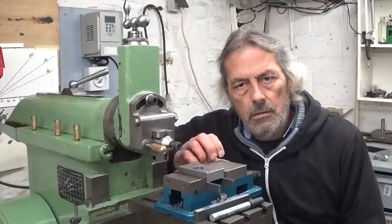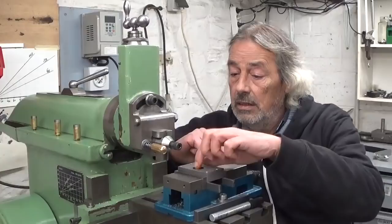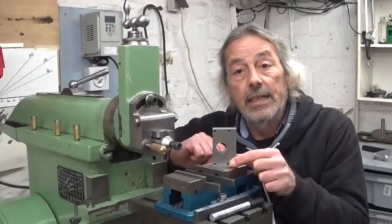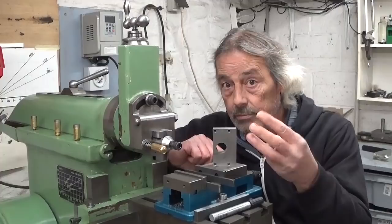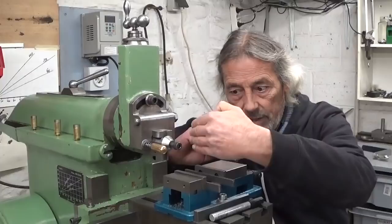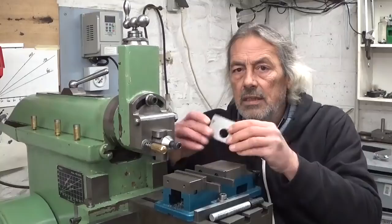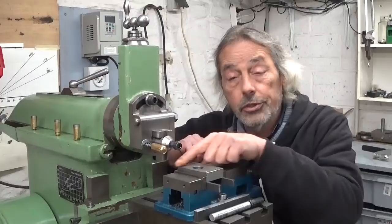Now that we're here comparing milling machines and shapers, why not continue? Let me explain. If you make a part like this one, same part in a milling machine, you can do this in 3 setups. That's all. If I make this part here in the shaper, I put my vise in the same way in a length direction. Yeah? This will not work. I put my part blank as deep as I can in the vise on a pair of parallels. Work one surface. Yeah?